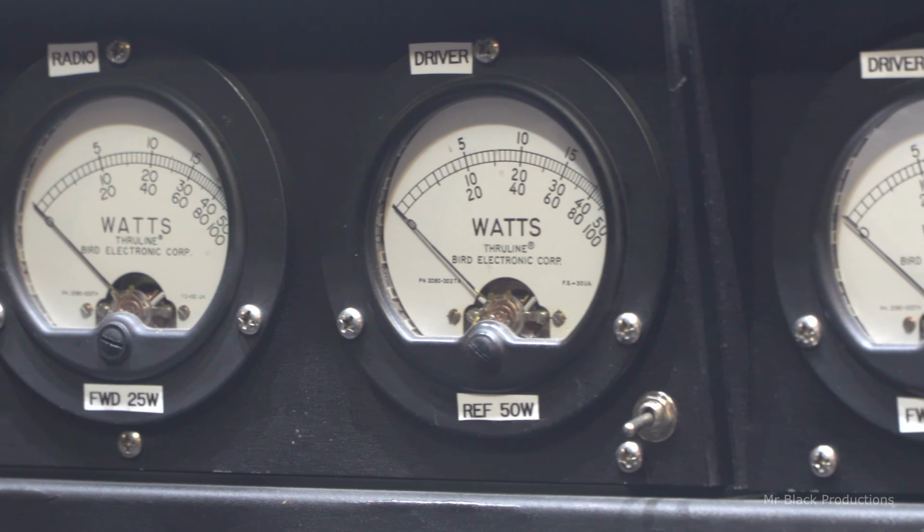There are certain batteries that will put out more current than you could possibly imagine, and they'll inrush it, but they're very delicate in their charge cycles and the environment you have to keep them in, like that Vectron setup that I did for my friend. It has to stay above, I think, 40 degrees at all times, because if the battery sees below 40 degrees, it's junk. If you discharge it below like 14.2 volts, which is fully discharged, junk. I think those are the specs. Off the top of my head, I'd have to go look, so nobody quote me on that out there in video land.